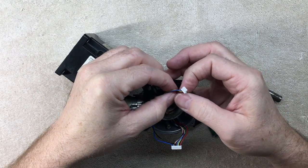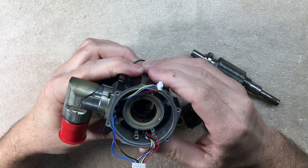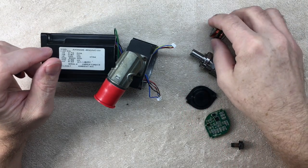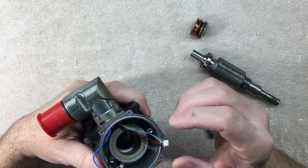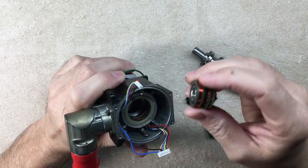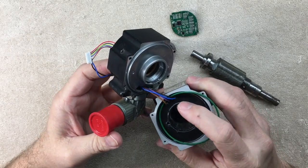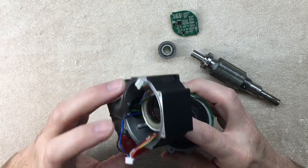It looks like we've got power coming in from the drive, and then just two wires — yellow and blue — feeding the feedback. Very surprised to see the resolver. I knew when I bought this system it was a newer digital-style feedback device, but didn't know it was a resolver. For noise immunity, heat, and vibration, it's very good. You can also see up close the three phases coming out of the potted winding of the stator, going up into the connector.